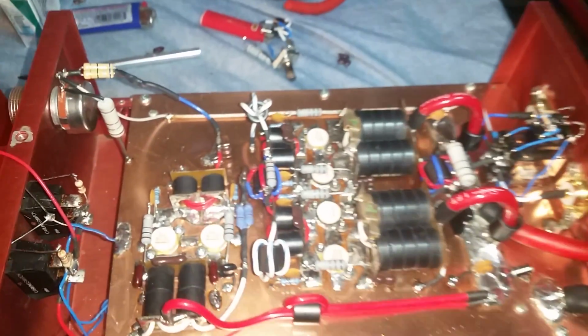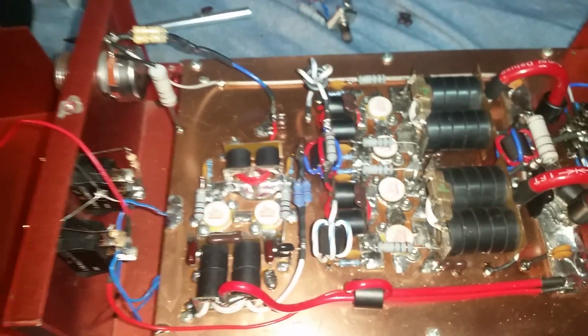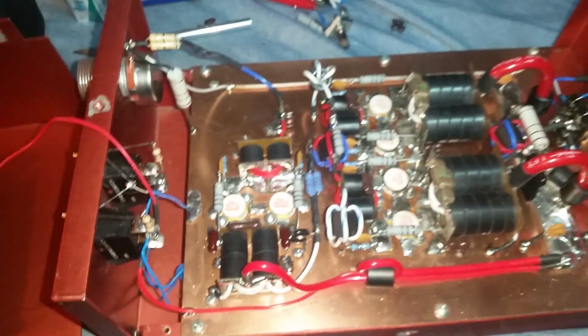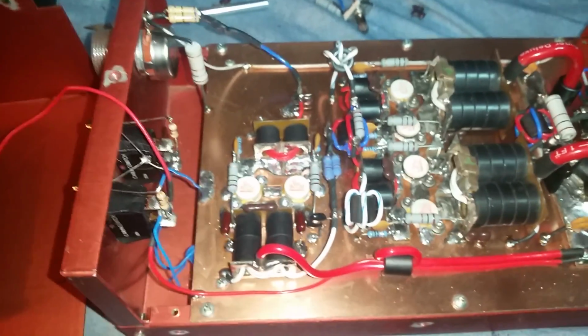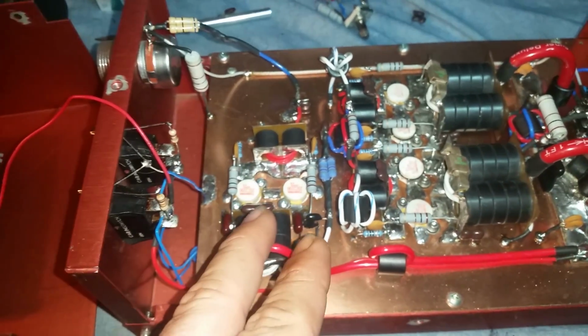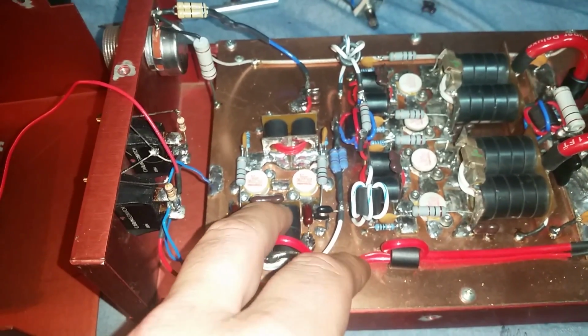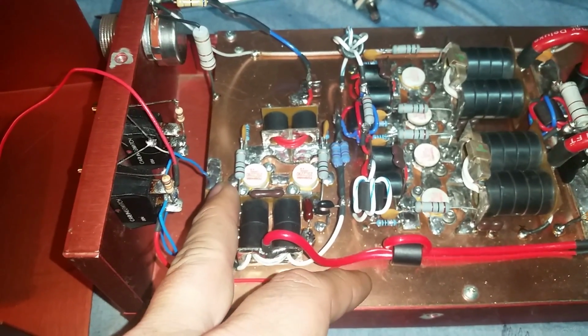And you could almost sit there and just gradually watch that dead key increasing. It was because the input tune wasn't really off that much. It came down a hair. I just improved it a little, but it just wasn't as stable as it should have been, because you're really supposed to be using these 330s on the 2x4.